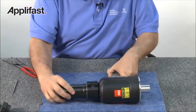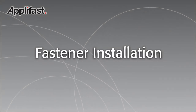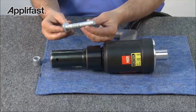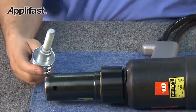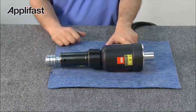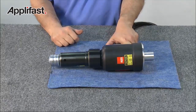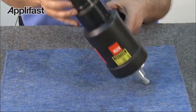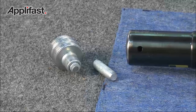Place the tool down on its side. To test the tool for fastening, use a C50L one-half inch pin and a C50L non-flanged collar and washers to simulate material thickness. Slide the fastener in until the fastening cycle is complete. Because the 3585 PT is a pass-through tool, the extra pin tail will come out of the back of the tool. Fastener successfully installed.